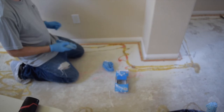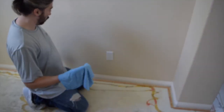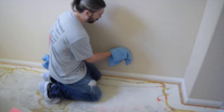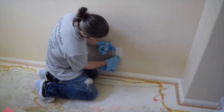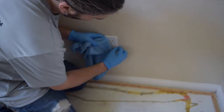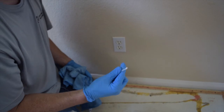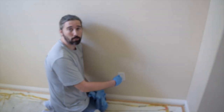This is the final step after I've got everything else cleaned down to the bottom. While I'm going around the room with my base trim, I've still got my deodorizing and rinse rag - that's when I'm going to hit my outlet covers, my switch covers, my light fixtures - kind of the final step in really 100-percenting the room. I'll get on top of that with my thumb and get on the edges there. I always like to do a good quality check on myself to make sure I'm not missing anything - I'll run my Q-tip across the top. This is also good for finding soot and particulate pressed in there. If I'm catching a lot, it might mean I need to take that cover off and look behind it to determine whether there's more that needs to be done.